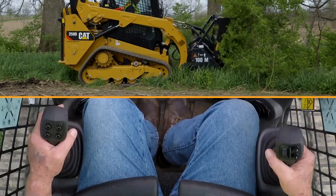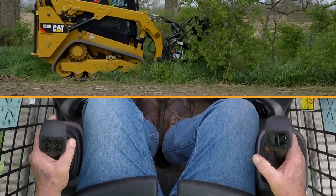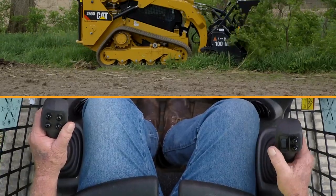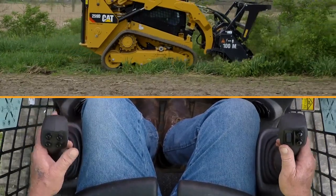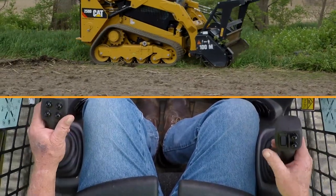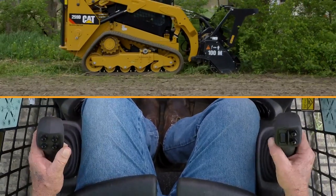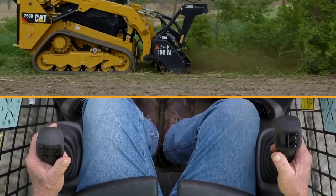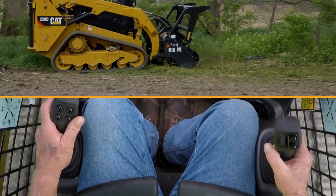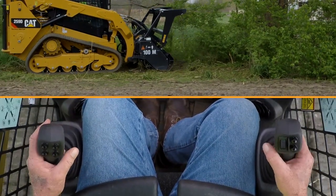The door is open. I like to make short passes as we continue through this foliage. The mulcher continues to run after my pass back. Be aware: this tool can cast material up to 300 feet or 100 meters, so always be cautious of your surroundings.